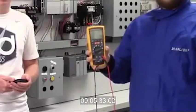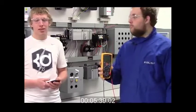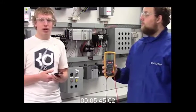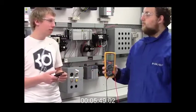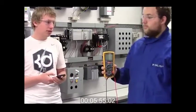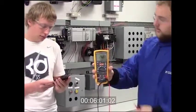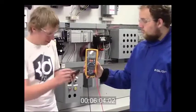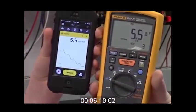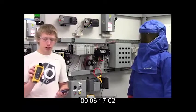Today we're going to be measuring the voltage across the three-phase motor starter with the Fluke installation multimeter. I'm Taylor Cruz, and I will be using the Fluke Connect feature to connect to the smartphone and store it on the Fluke database, because we only have one PPE suit so it's only safe for Travis to go in the booth. Now we're going to set up the meter to connect to the phone so we can record the measurements. I'm going to set the multimeter to volts AC and press save so it connects to Taylor's phone. Now that it has come up, all you have to do is click on it and the two will sync with each other. Now we're going to take a 10-second recording of the current flowing through each phase of the motor using this meter.